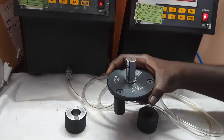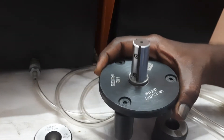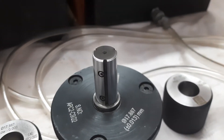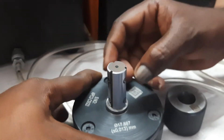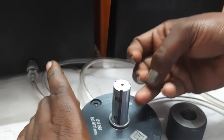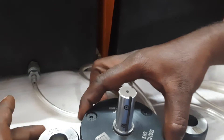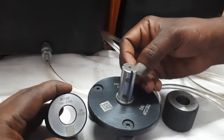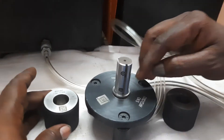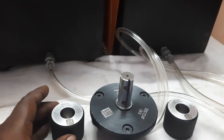This is one section. If you have a bore length more than 20 mm or 30 mm and you want to calculate the taper throughout the bore, we can set sectional measurement. The first section has one set of jets and the second section has another set of jets. So we can observe the diameter at one level and the diameter at the second level. Additionally, 3 jets at one level will provide the average diameter.